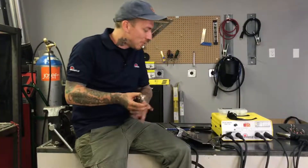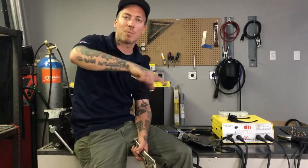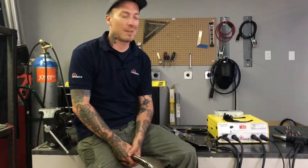That's something you can use if you need to fasten bolts all over your project and you don't want it to be marred on the back, and you don't want to be messing around putting a weld around the bottom of every single one. You can use a stud welder like this and just bang them on very quickly. For certain types of production shops I think that would be a very invaluable tool — it would save you a lot of hand welding over and over again.